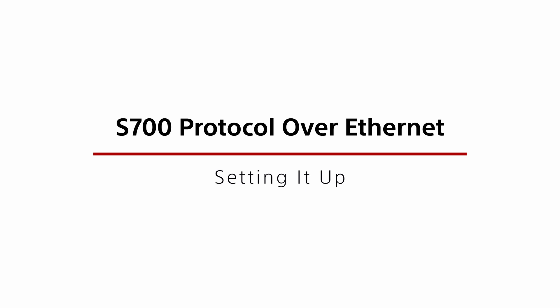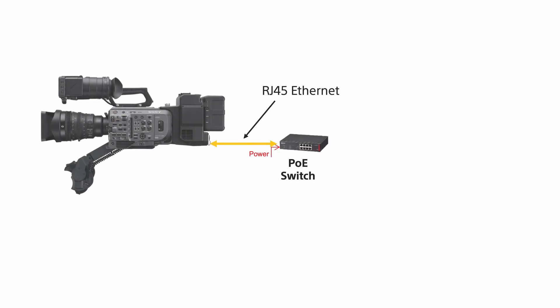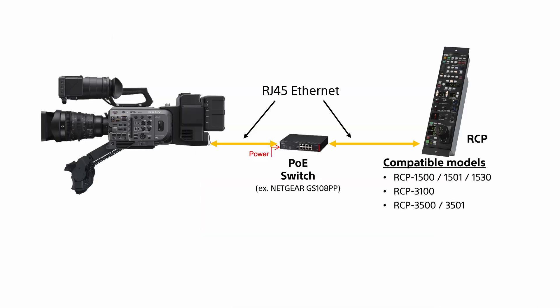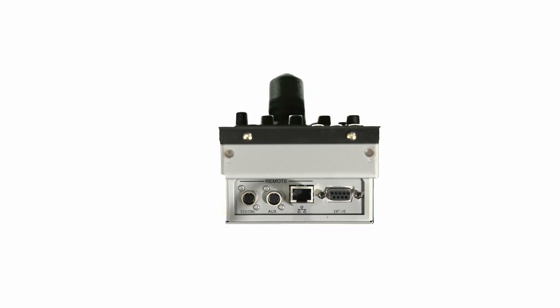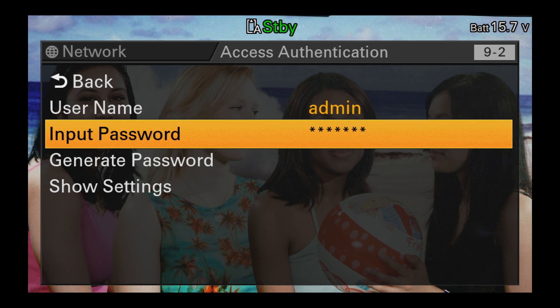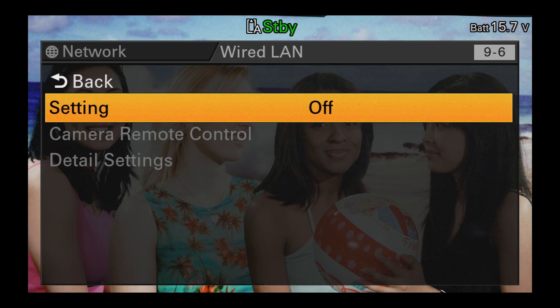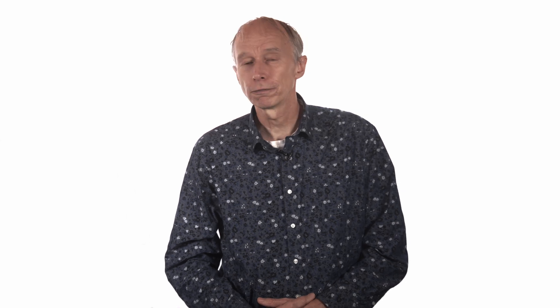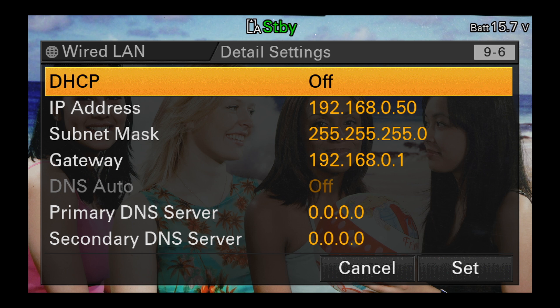So let's take a look at how to set it up. The camera needs to be connected to the Ethernet switch via an Ethernet cable plugged into the XDCA FX9. Then a port on the switch that provides power over Ethernet is connected to the Ethernet port on the RCP panel. On the camera, in order to enable its networking functions you must first set a username and a password in the network access authentication settings, and then once you have done this you can go to the wired LAN settings and turn on the wired LAN as well as turning on the camera remote control. As you will not normally be using a router and the RCP doesn't provide network addresses via DHCP, you should turn off DHCP and manually enter a suitable network address for the camera.